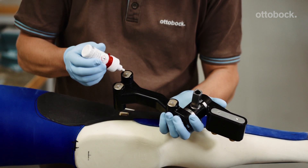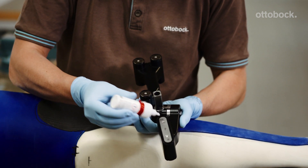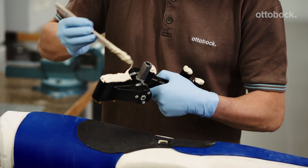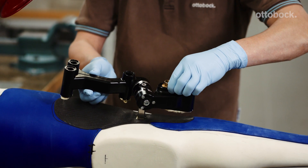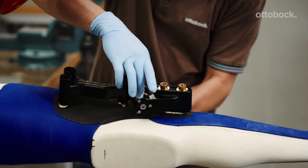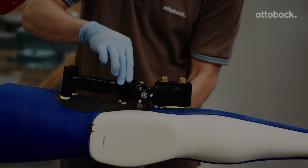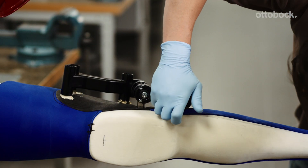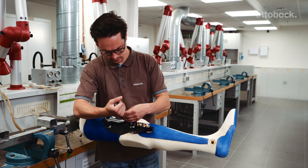Use small amounts of super glue to reinforce the bond between the putty and the anchor nuts and anchor plate. Apply a KMI fast curing putty to the anchor nuts and anchor plate, then place the positioning dummy onto the model. Do not use a different putty or adhesive since these could deform while hardening and/or under vacuum. Make sure that all anchor nuts and the anchor plate have good contact with the carbon and remove excess putty. Depending on the model and possible dummy positioning, a larger quantity of KMI putty may have to be applied.